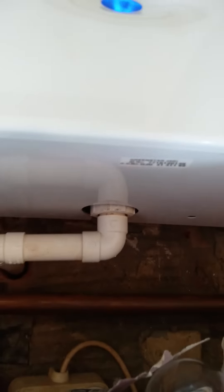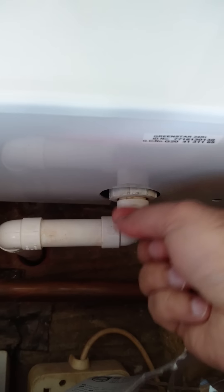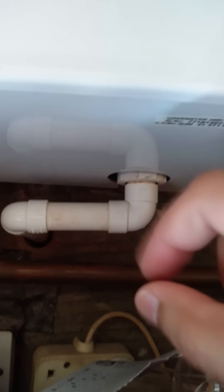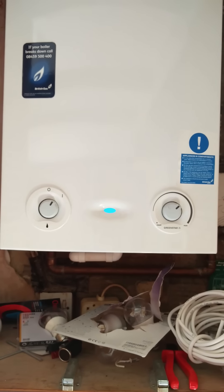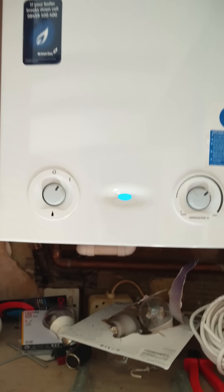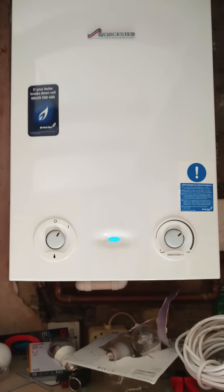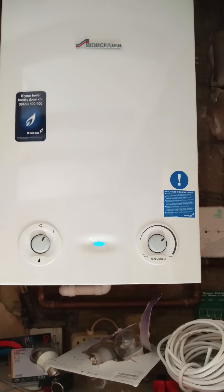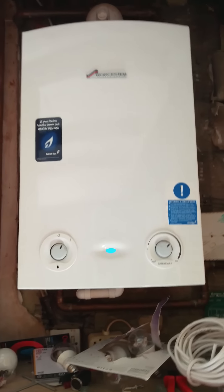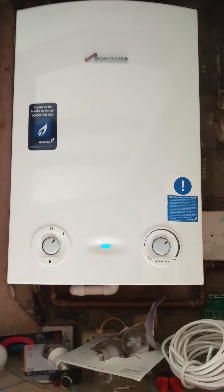The box, from what I recall, was held on by this plastic nut down here. On the other end of that, past this cover, you'll see the yellow box, and inside there's another pipe going into it — I can't remember if it's horizontal or vertical — and that pipe has another plastic nut which will unscrew. You will get a little bit of discharge of water because it's a condenser outlet. There won't be main water, so you don't have to worry about turning off the mains. It's not your heating system water — it's just the condensation coming off the boiler.